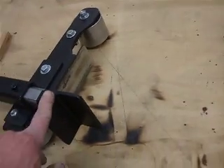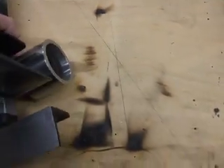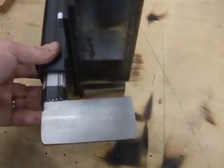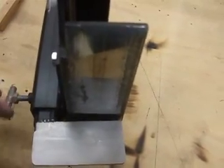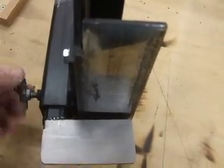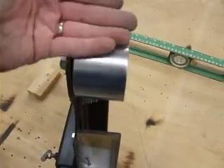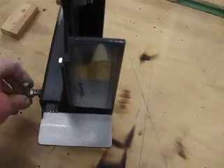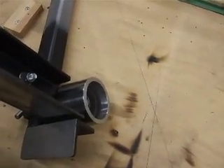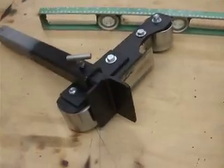So it slides right in. This piece here is real simple — it's just a piece of 2 inch angle, quarter inch thick, and it's 4 inches wide. It slides up against the platen and you can tighten it down. It's just a rest — it makes it really handy if you've got a part that needs support when making rounded corners. You can actually change the belt with this in place because the belt comes down around here and you can slip it past the gap. I got it as close to 90 degrees as possible, and you can see it's had a lot of use — it's already got a real nice polish on it. And that's it for the vertical.